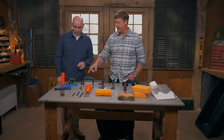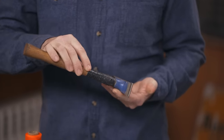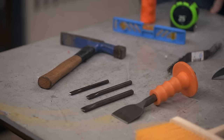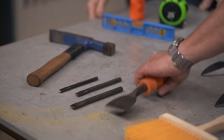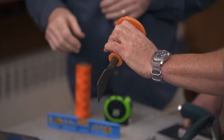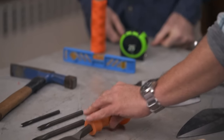Your brick hammer there — well-worn. This is my own brick hammer right here, and you can see I've got a nice edge on it, so if I have to cut a brick or a stone. It is impressive to see someone cut a straight line with a blunt tool. A lot of practice, but it happens. We have a variety of chisels — they're different sizes because we have different masonry joints that we might have to extract from, say, a stone wall. They vary quite a bit. And the big boy right there — so if you've got to do any chopping into cement or even a brick mortar joint, that's going to be the guy. This orange protector right there is going to stop you from getting hurt if you do miss.